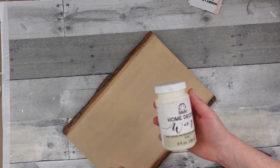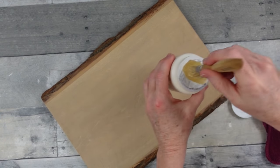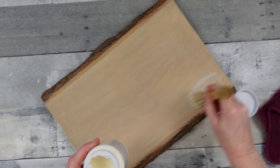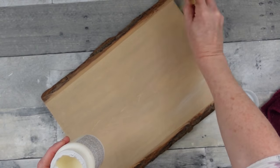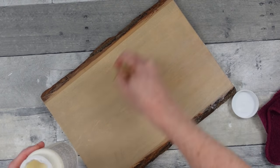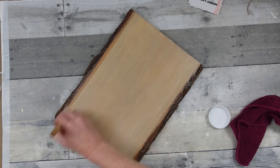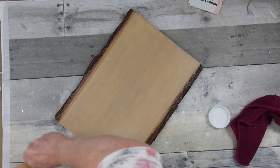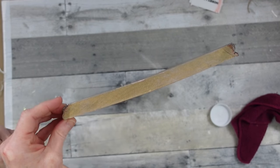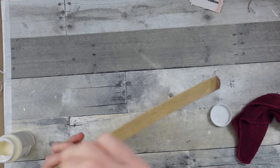So now we're going to take that other piece and wax it. I'm using a little more of this translucent clear wax and going all over here. I use a brush this time instead of the foam brush because I want to be sure I can get in the edge of the bark on the side — that helps keep the wood conditioned and prevents any continued flaking. It'll dry clear, and then you just buff it out just like we did the other pieces. It's kind of rough on the edges even when you sand it, when you do the grain like that.